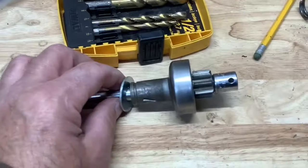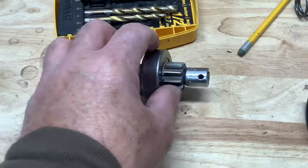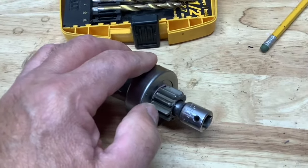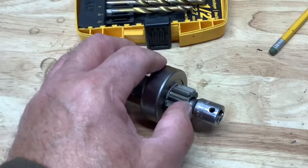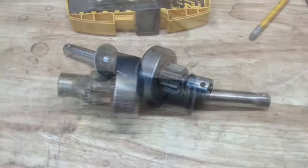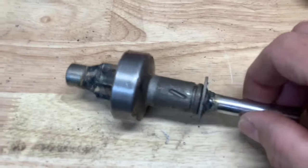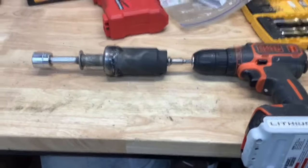What will eventually happen is this outside will turn — and you can see it's independent of the gear portion. Once the generator starts, this inside part is actually going to spin freely while I pull the starter off of the generator drive, so it doesn't tear the drill up or rip it out of my hands. I've now welded the extension to the gear, put that little piece of mechanics wire in, and tack welded the washer to hold it in place.